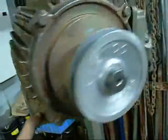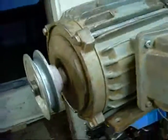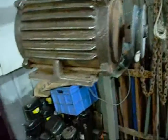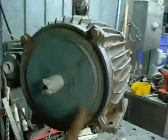I've given this one a good wire brushing with the grinder and it's reasonably good - a lot of pitting from the rust but water hasn't gotten into the bearings. She runs smooth, it's electrically fine, so I don't see any reason to tear it down and use electrolysis on the end plates or anything. I have the end cowl or fan cowl in the electrolysis tank at the moment, and that seems to be stewing away nicely. I'm going to paint the motor body like they did at the factory, then paint the cowl, fit that up, and that'll be the end of it.